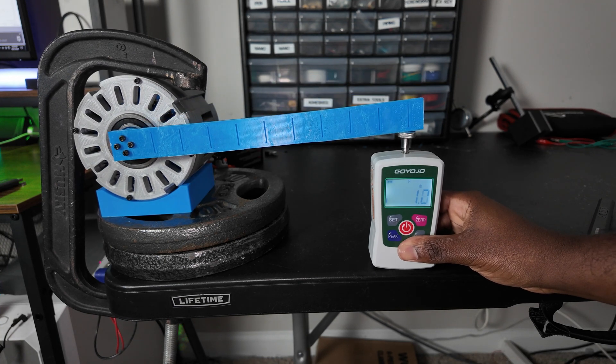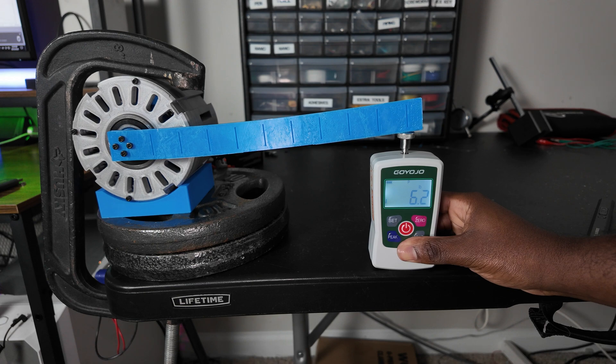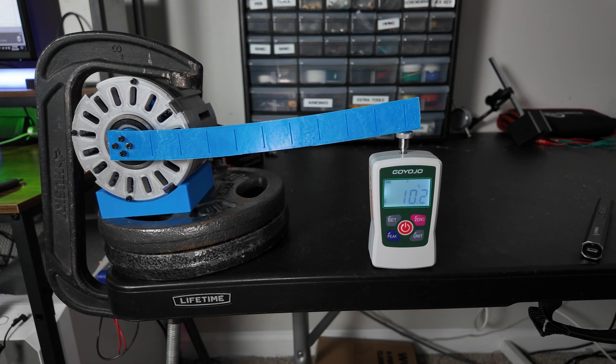When we tested the accuracy, we did it at five inches. I tried to test the torque at five inches too, but one, the force was just way too high, and two, the ruler wasn't thick enough. So we're going to make a longer ruler, test it at 10 inches, and then extrapolate to see how many pounds of torque we're getting per inch. We printed it 100% infill and increased the wall count from two walls to six. And if that doesn't work, we are screwed.